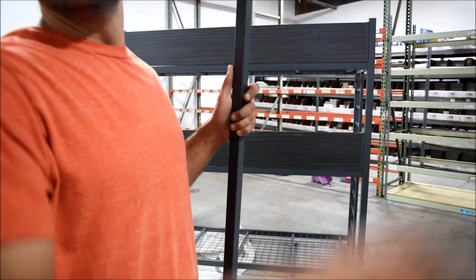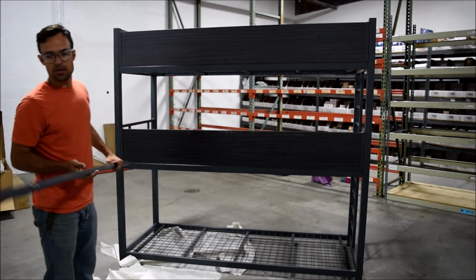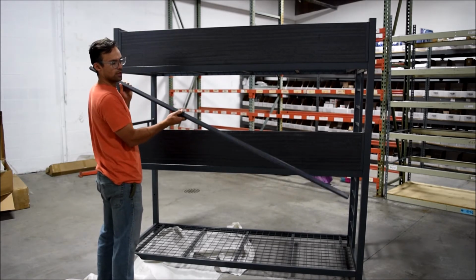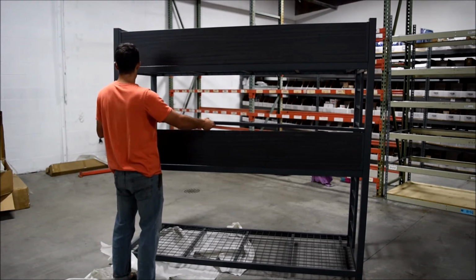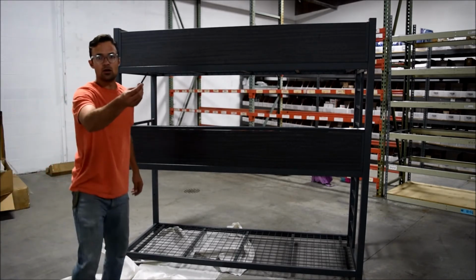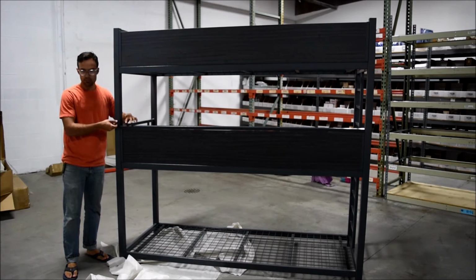into place quite yet. Okay, so I went ahead and turned this half of the bed around so that the wood panels would be facing us. So now that these wood panels are in place, the next step is to take these long rods, and you'll notice they have these 4 holes on them. These 4 holes will point inward, not down, not up, but in. And you'll go ahead and just place it on top of the wood panel, just like that, and use the longer bolts, these longer bolts, to anchor them into place via these long vertical posts. So you just put those in by hand.